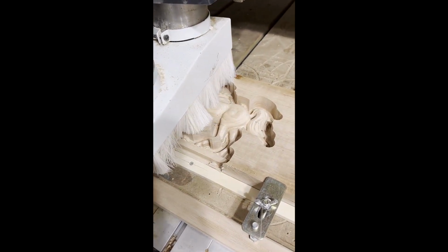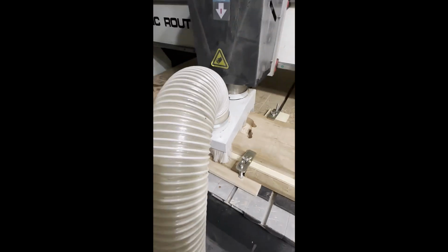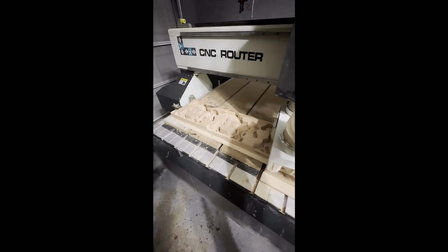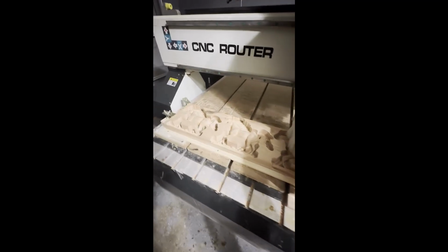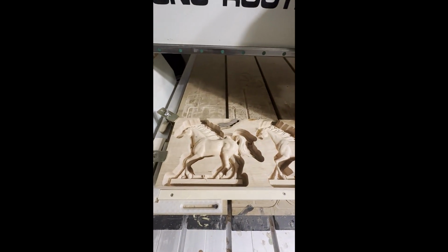Smaller stepovers and shallower cuts are employed during this stage, refining the workpiece gradually to achieve the desired smoothness and detail. Look at how the ball nose cutter delicately shapes the material, bringing our design to life. The result is visually appealing and meets the specifications of our project.